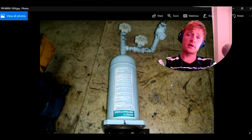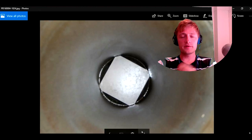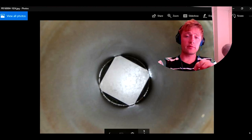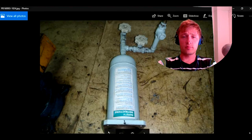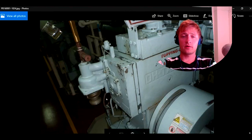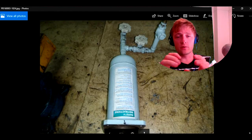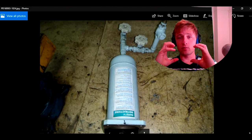Before taking it out, you need to switch off the compressor lock and put some signs. We are looking for any metal parts. If you find metal parts here in this section, that means your piston rings of the compressor are worn.